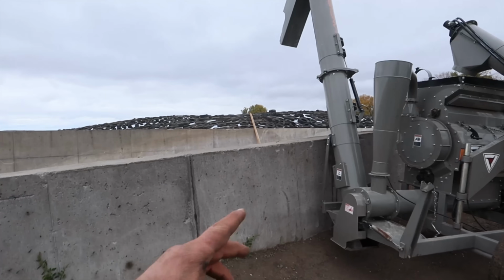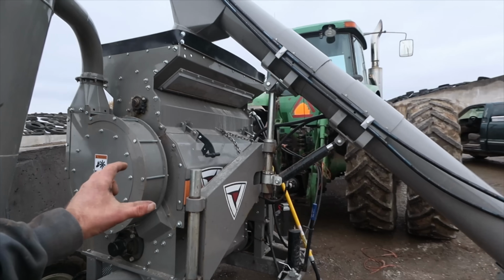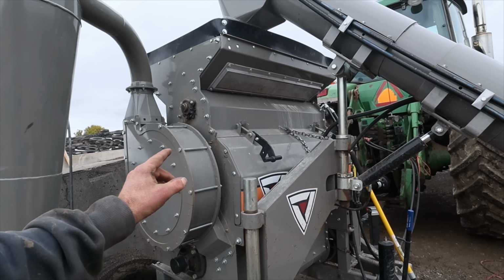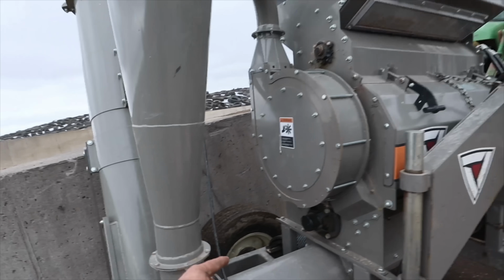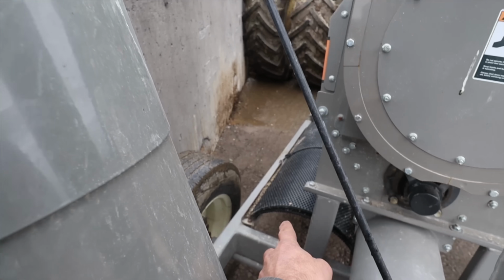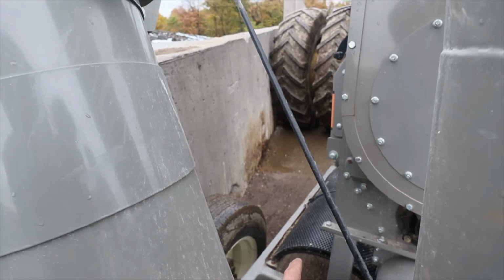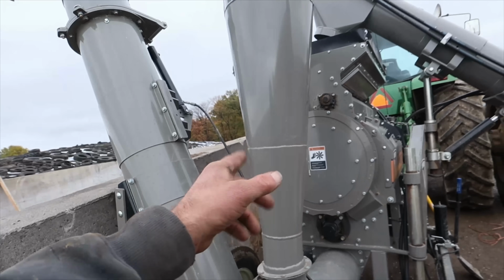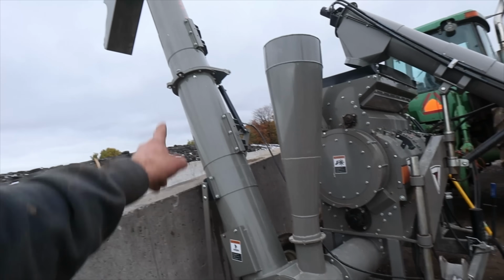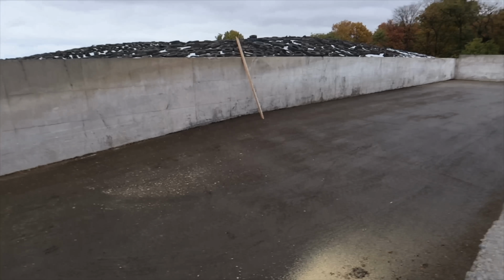blower off it. Now this is a hammer mill, and it has little metal pieces of flat stock that spin really fast, and it actually pushes the corn through a screen. There's different size screens on here. There's a whole stack of them there. Anything from 3/16 all the way up to 7/16, and it beats that corn through the screen, drops it down